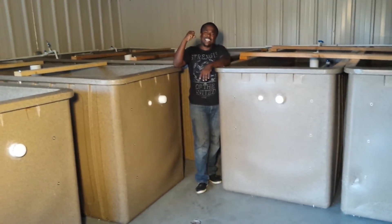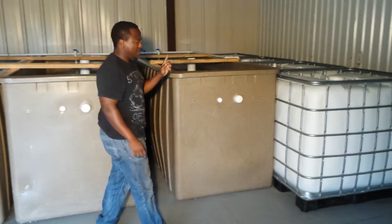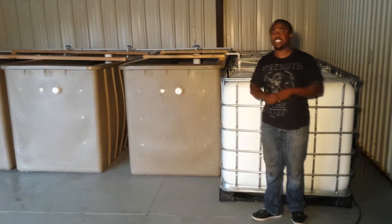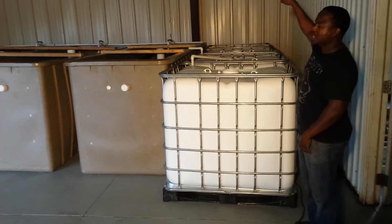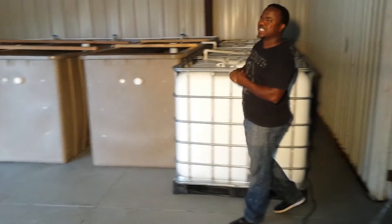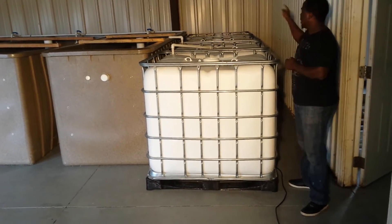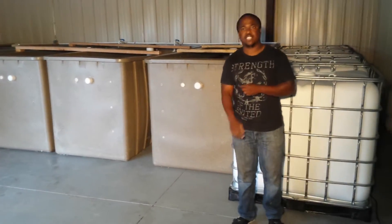But here, we're able to fit seven 1,000-gallon tanks, not including our filtration system. Each of the filtration systems uses IBC totes, and we have three filtration systems and one reservoir to refill any amount of water that will be lost due to evaporation and what the fish consume. On the other side, there is an outlet that cycles the water back to the greenhouse — we're still working on that, but that's the future goal. The first filtration system is a solids filter, the second one is for media beds with media balls for bacteria breakdown, and the third one is where the pump sits so water circulates again. The fourth and last one is the reservoir to refill the water lost in the system.